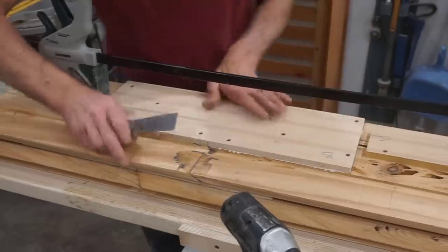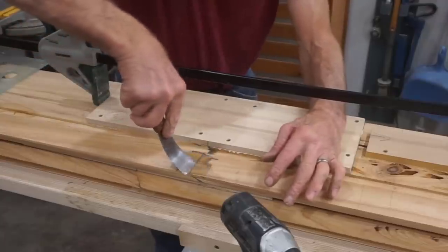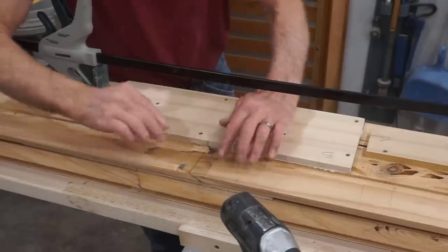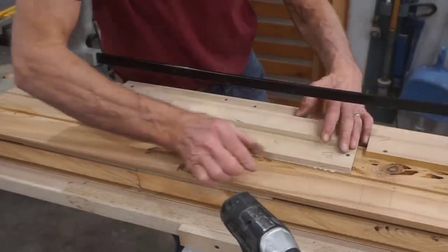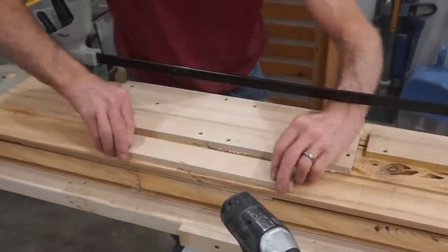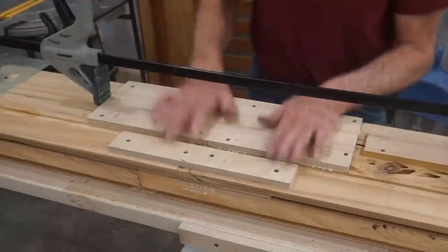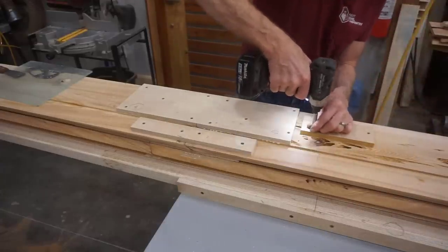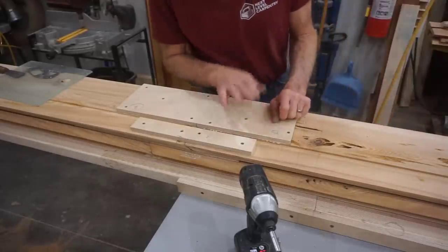But another thing I'm doing on these beams, because the faces are so wide and I can't glue over this dado, I'm putting a little temporary piece on the top of the beam here. That'll help hold everything in alignment as the epoxy sets, but then I'll remove the block for the final installation of the beam, because there'll probably be a bracket screwed to the roof truss somewhere in here. So this one doesn't get glued down, it just gets screwed in place for strength as the epoxy cures overnight. And once everything is screwed into place, I can take off the clamp and remove this little clamping block here, because it would just be in the way later during beam assembly.